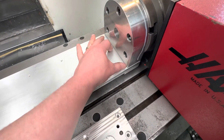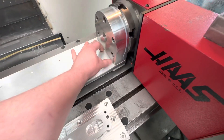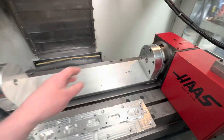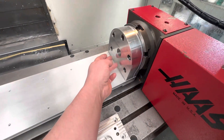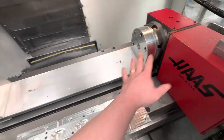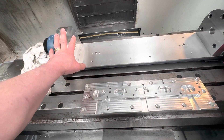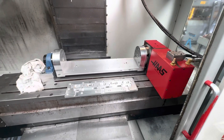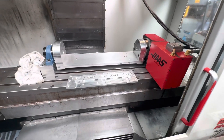That's why I put dowel pins in now — because if I didn't, next time I centre this up it could be off, since the holes for the M16 cap heads have about a millimetre of clearance and the plate could end up a millimetre to one side. I wanted to pin it with dowels so this is going to be one unit, not get taken apart and put back on misaligned. Then we've got our dowel pins in the supports.